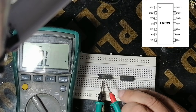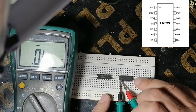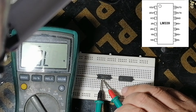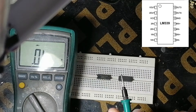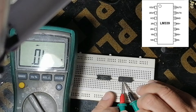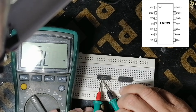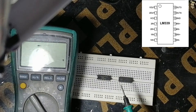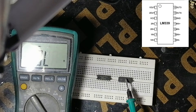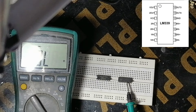This is the new one and this is the old one, so I make the comparison — I read the old one first. There is no reading. I make comparison with the new one — as you see there is no reading. So I change the direction — there is no reading. The readings between pins are the same or similar to the new one, so we decide that this IC is working. Thank you for watching.